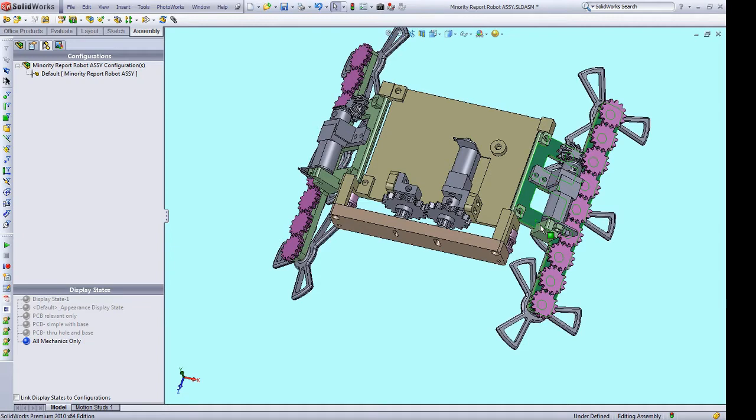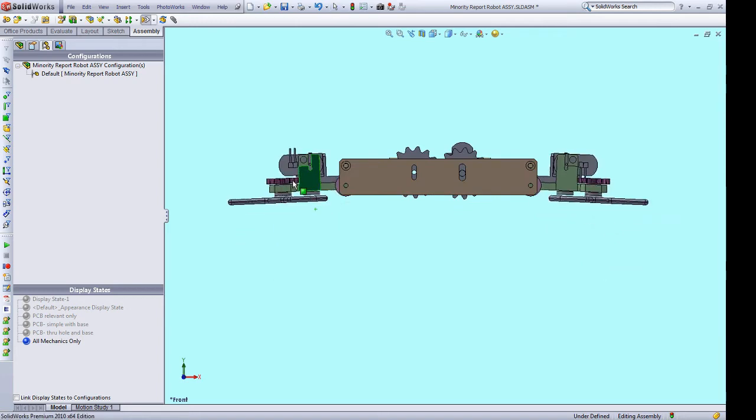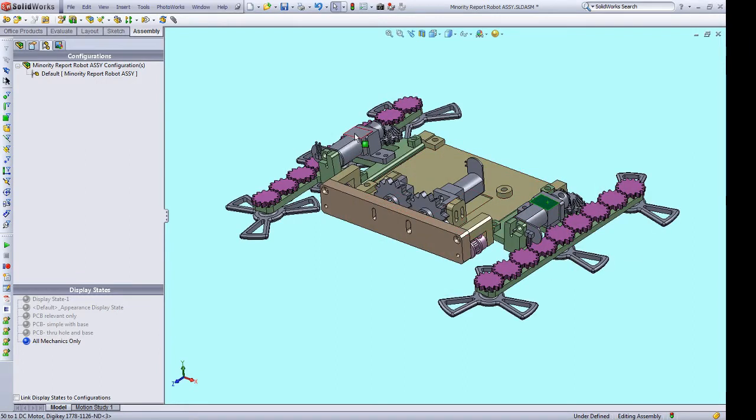The reason we use gears and not just belts on the two sides is that each side has to rotate in an opposite direction in order for the robot to change its height. These gears provide the means to reverse the direction of rotation from one side to the other. This sprawl feature is really innovative and is what allows the robot to flatten itself to go under a door. The other two motors each drive the hybrid wheel/legs, also called WEGs, on each side of the robot. They use the bevel to spur gear arrangement that I showed in the part 2 video.